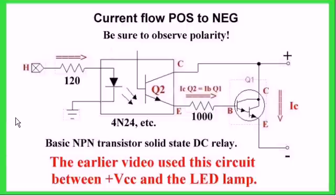Here is another variation of using an optocoupler. This time, we connect the collector of the optocoupler detector right to the collector of the transistor, and the emitter through a 1K resistor is going to switch on Q1. This is really a solid-state relay, and I use this in several of my other projects and videos. Note that with all of these circuits, unless you've put capacitors in them, you can pulse width modulate them — using them as a switch on either the high side or low side of a load.